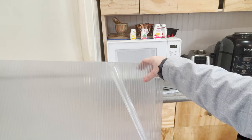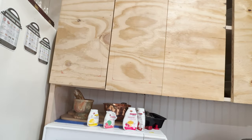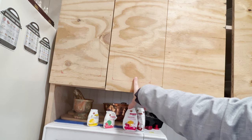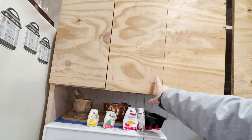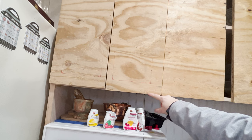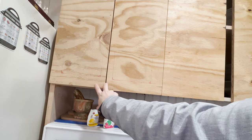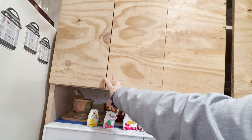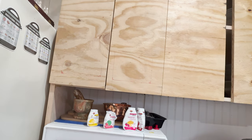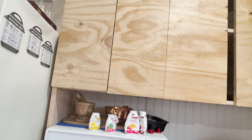I'm going to give it a try and see what happens using this as my glass insert. That makes me think: how big do I make the framing? These are small doors — only ten inches wide — so the glass insert isn't going to be very big. The concealed hinges come out not quite full two inches, so my thought is two inches all the way around. But then I thought that might look kind of bulky in the middle, so where these meet: two inches, two inches — one inch, one inch — so when closed it will be a two-inch piece of cabinetry, which looks more balanced.